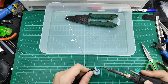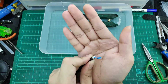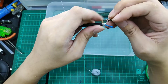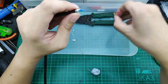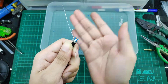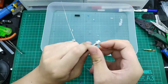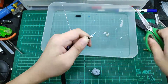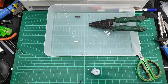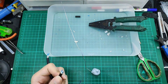We'll twist them together to form one conductor. This part will tin the ground conductor. We do have 2 other blue cables — we'll use them for the signal. One side is prepared. We have to do the other side to make the process quicker. We have one issue here currently: because this is a long length of wire, we don't know which is the left and the right on the other side, so right now we will require the tester.